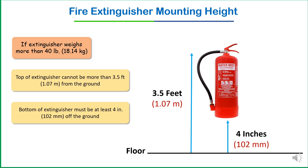The second problem you will face is increased risk of injury. Trying to lift a heavy extinguisher from a higher position can strain the user or lead to dropping, causing injury or damaging the extinguisher. The third and most important consequence is that exceeding the height may result in violation of NFPA 10 or local fire regulations, leading to penalties or rejection during inspection.